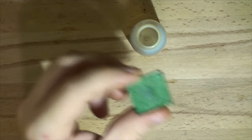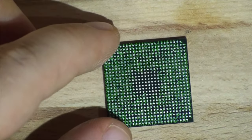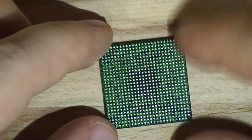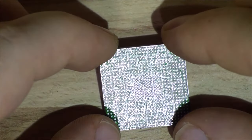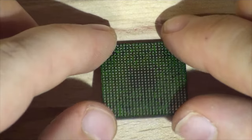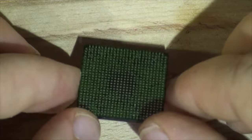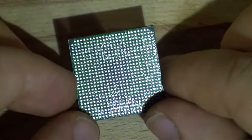After cleaning with a cotton bud, grab a paper towel and again using lacquer thinner, clean it properly everywhere. The chip is now really nicely cleaned up — all the tracks are clean, there is no solder left in it whatsoever. It is nice and clean everywhere and ready for re-balling.